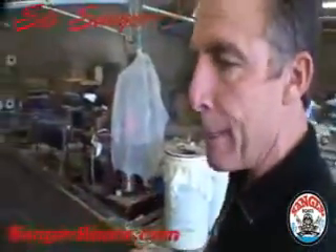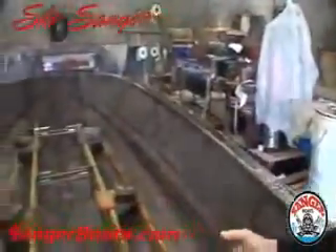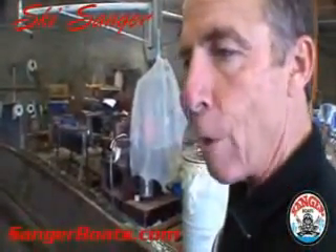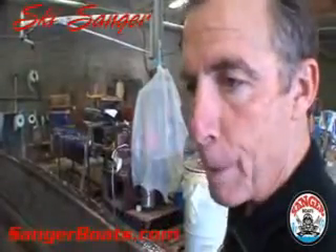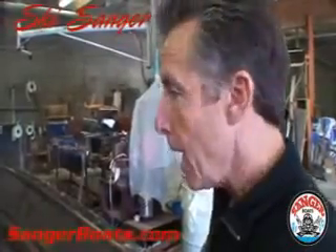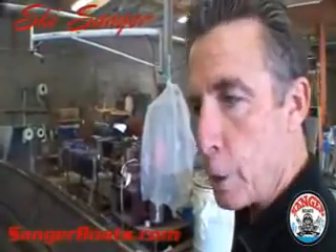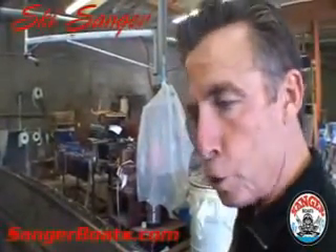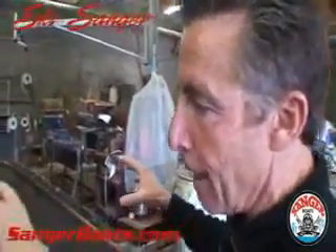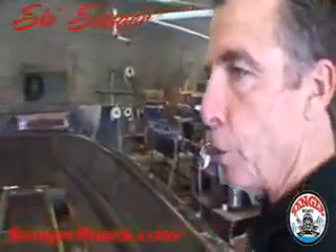So that's the major difference in the way that we laminate our boats. We use sheet glass and we control the process. We use wood-cored stringers — those are still composite stringers, they just happen to have a wood core rather than a hollow or foam core. We use no foam in our boats whatsoever because we do not rely on foam for structure. A lot of other boat companies, if they didn't have the foam in the boat, they wouldn't have any structure based on what they're using in glass. When you drive a Sanger boat, you feel the fact that we laminate our boats differently and that we have wood-cored composite stringers. It makes all the difference in the world from a structure standpoint.